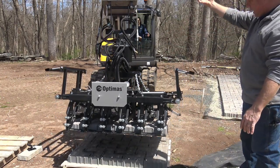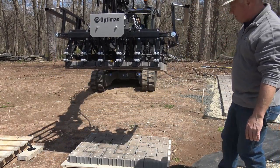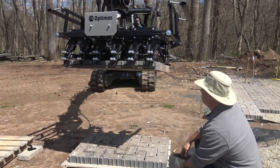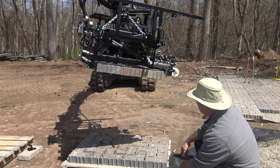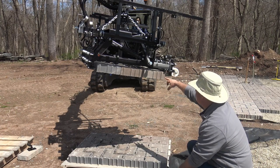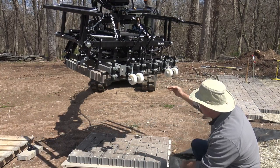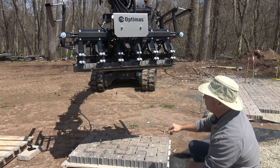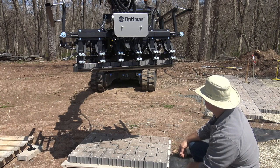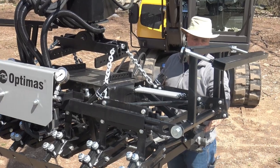He's going to pick up in the air, and I'm going to check to make sure we don't have sag in here, because sag could create dropping. You can see we've got a nice straight line — no sagging. We're clamped and we could drop it down a little further if we wanted to clamp lower. You want the clamp right there at the bottom so when it releases you're not catching any sand or your number eight stone setting bed. Next we want to back off these stoppers — they stop the alignment arms when they come down.